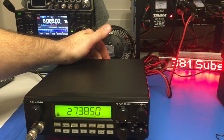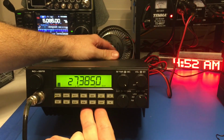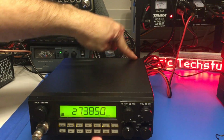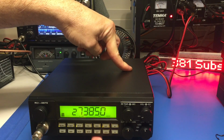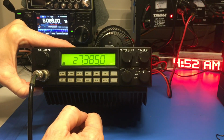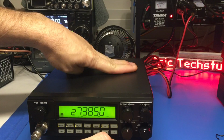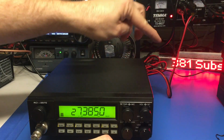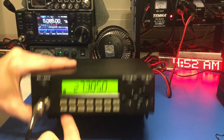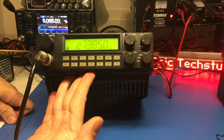So yeah, I may relocate that in the future, but as of right now, it is indicating when that is on and off on this amp, because it's always on. The amp always gets power. It's actually drawn directly off the main, so if this is powered up, that amp is still getting current to it. I actually had to rewire the switch because I wired up the light to it, and when I turn it off, of course, the radio stays on. The main's in the back here. You'll see where the two tabs are that hold positive and negative that run to the amp, and then also out to the back of the radio. So that always is on. So this light, even when the power was off, was still glowing when the amp was on, so you had to turn that off every time too. So that was kind of a pain, but good to know.